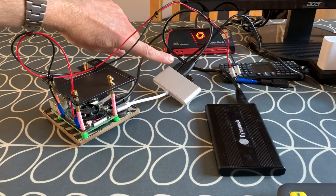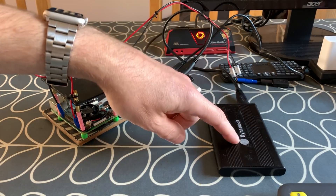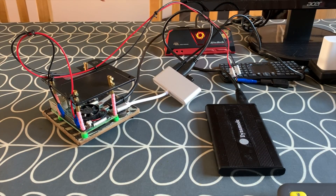This is the official Raspberry Pi USB-C adapter, this is my SSD drive which has got Windows 10 on it, and that's my mouse and keyboard trackpad going through the USB-C input with HDMI out. At the moment I'm not using the extra GPIO power, but you can use both lots of power at the same time. I'm not advising anybody to do this without reading through the guides thoroughly. A guide I found said it takes as much power as it needs through the GPIO pins, and I'm only using a 5V adapter so it shouldn't overload it — but do this at your own risk.